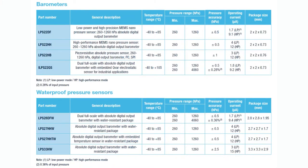They are part of a family — we actually stock quite a few ST barometers and pressure sensors. I think we stock the LPS22, the 25, and the 33. So you can see some of those. But as you can tell, pretty much all of them except for the 28 only go up to 1260 HPA, which is basically sea level.